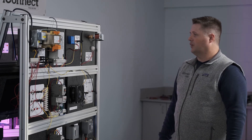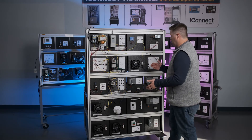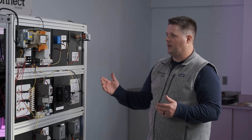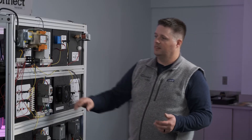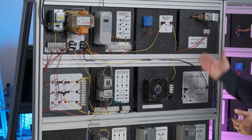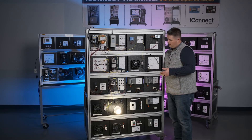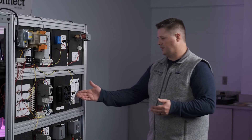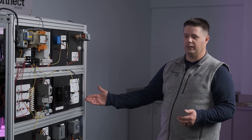We're also using a time delay relay to prevent short cycling of the compressor. As we turn this on, the fans come right on, and then we have a call for cooling right away. There'll be a delay as the time delay counts down before the crankcase heater shuts off and the compressor comes back on. After the time delay makes, the solenoid activates, the compressor comes on, and the crankcase heater turns off — the compressor is now operational.